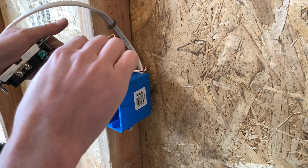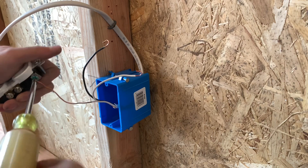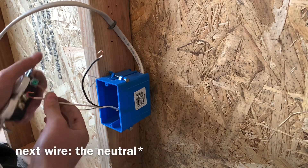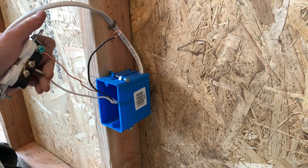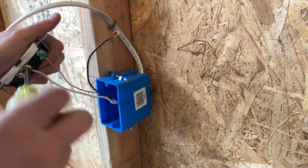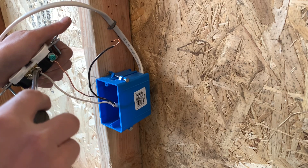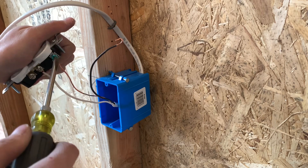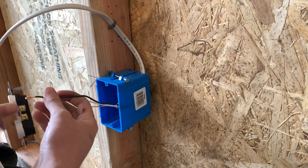If you need to, you can tighten these down a little bit — if the curls are a little too loose, go ahead and screw that down. Then take your neutral onto the silver screw. That one's a little too loose, so go to a looser screw, tighten that, crimp it down a bit, tighten the curl. Before I flip it over, I'm going to tighten it with my flat-blade screwdriver — just be careful not to stab your hand. Once you get it about maxed out it's going to want to slip, which is always a little scary.